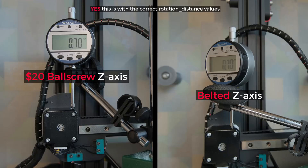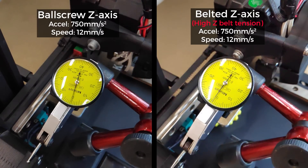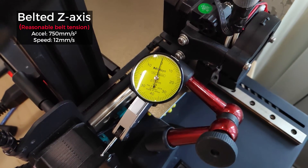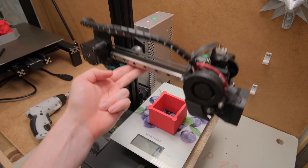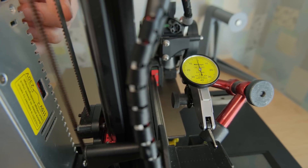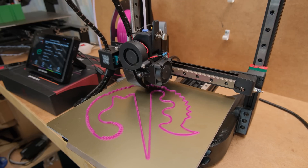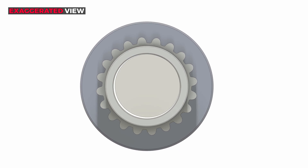You see, a ball screw makes the Z-axis extremely rigid and every tiny movement of the stepper motor is directly transferred to the axis. Meanwhile, with the belt on the axis you need to tighten the belt a lot to get even a somewhat rigid-like setup. But it will still never reach that point and there will still be some play in the axis. This leads us to the high belt tension wearing down bearings way more, so we couldn't even argue that this is a great choice for the longevity aspect. Of course, reducing the gantry weight or having multiple belts would improve things a lot, but it will still never be truly rigid. And with high speeds and a lot of vibrations, it could even introduce unwanted resonances into the Z-axis. Also we shouldn't forget that pulleys will never be perfectly centered on the shaft and that will affect the Z-axis movement consistency.